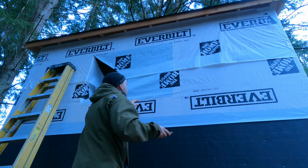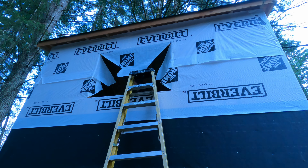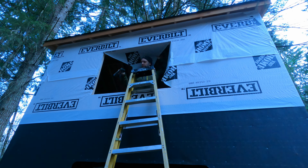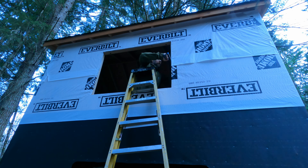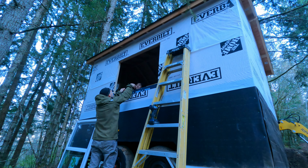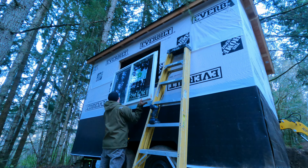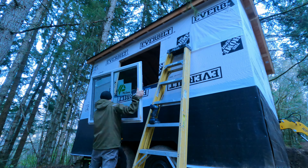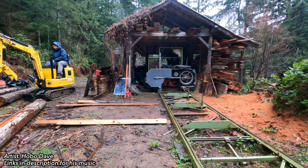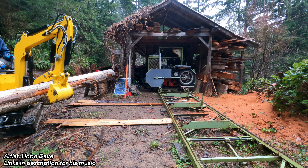Right here I'm excited — I'm going to get the final big window. I have some help coming to put it in place. I'm rolling back this house wrap and going to get it stapled back, and I'm going to be losing daylight in another half an hour or so. I'm going to pass the window up. And at that moment I realized I made a mistake — I had a note in my phone I forgot to look at about a month ago that I framed that window an inch and a half too short. So I had to cut down the sill, which we'll come back to later.